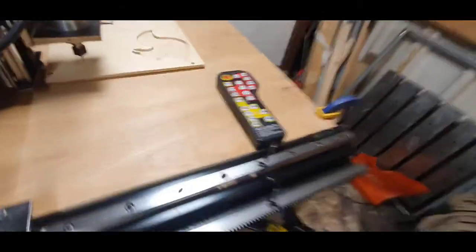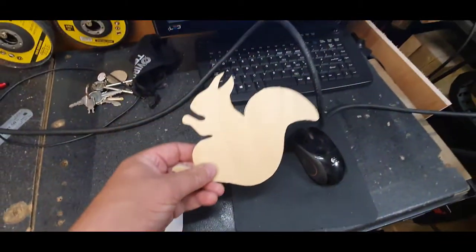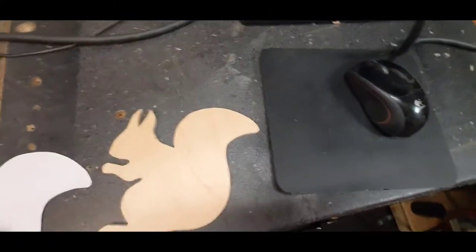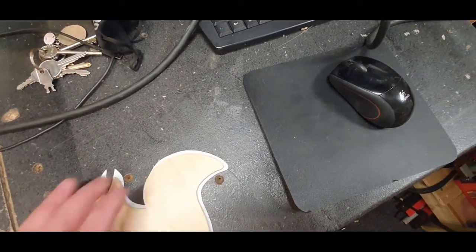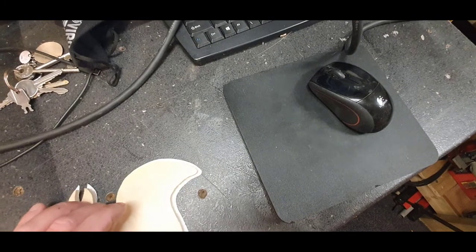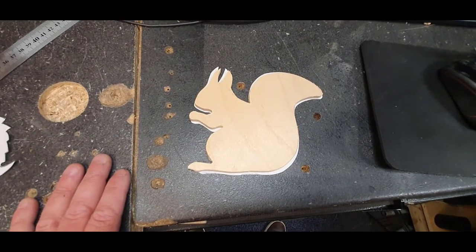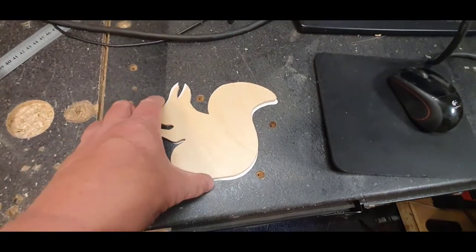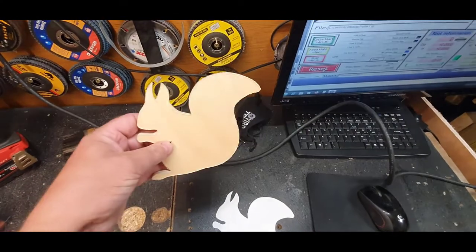I've just jogged it up a bit to get it off the rails - that's the gap. And that's our little wooden scroll - a nice clean cut from a plasma table. Let's see how well we did size-wise - this is just eyeing it up. Not too far off. I'm sure the kids won't recognize the difference at all. And that's how you cut wooden objects out on your CNC plasma table. Thanks for watching guys.